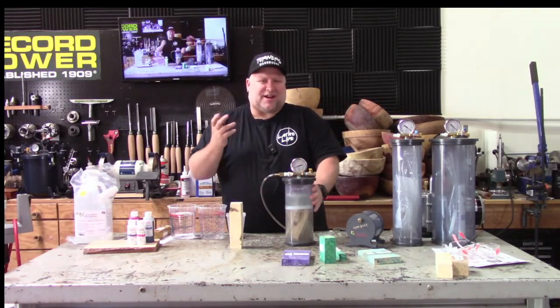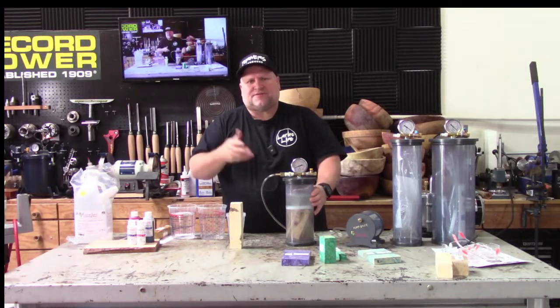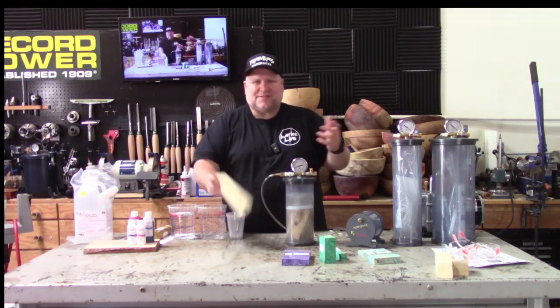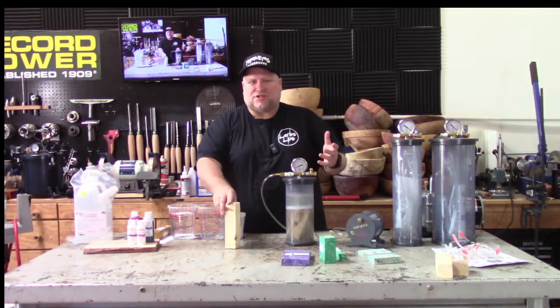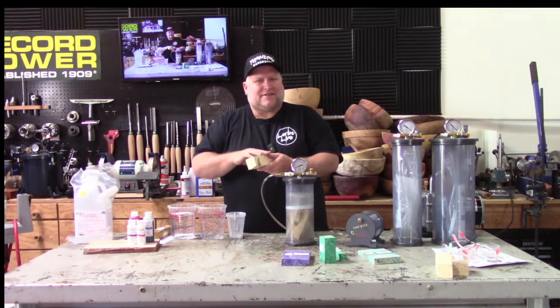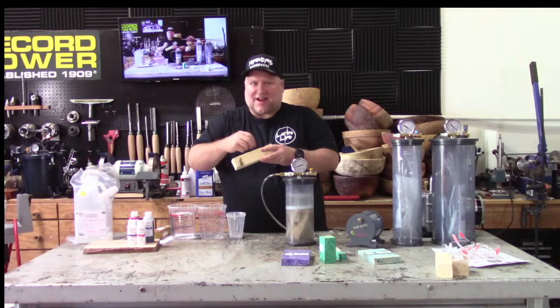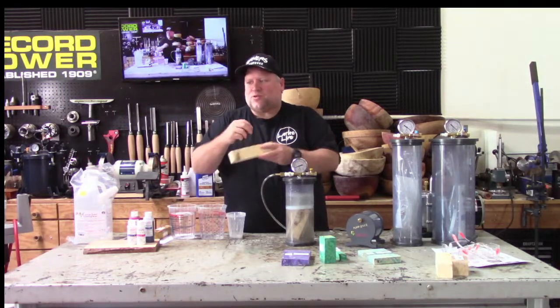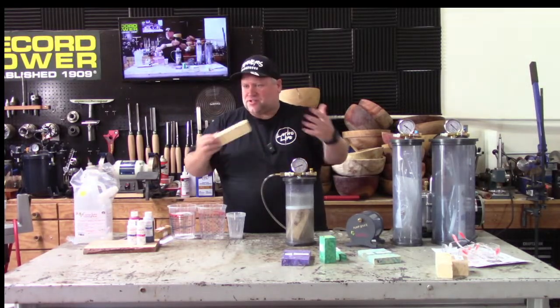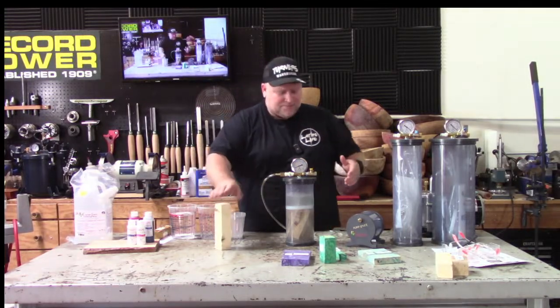Yeah, I usually dry it in an oven. It doesn't take a lot, like 100 degrees for a couple hours. Usually, if it's been sitting on your shelf for years, that'll do it. If you don't have a good moisture meter, you can weigh it, put it in, and if it doesn't change, it's dry. If it changes, write down the new weight, put it in a little more until it doesn't change, and then you know there's nothing leaving it. So that's one way you can dry if you don't have a good meter.